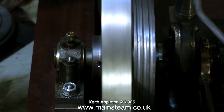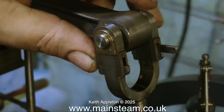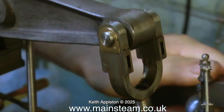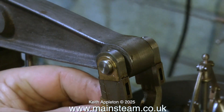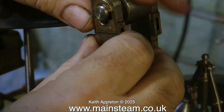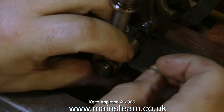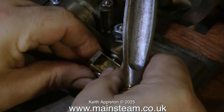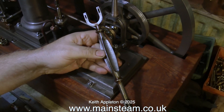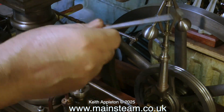I'm going to have the whole thing in pieces and have a close look at it. The cotter pins come out very cleanly — no bodging, they fit perfectly, and the squareness of the holes has to be seen to be believed. These parts are so well made I'm having to use a hammer and a small piece of brass to release them even when the cotter pins are withdrawn. At the moment this engine puzzles me — the machining is to a high standard, particularly the smaller parts, but when the thing goes together it's a bit of a disaster area.